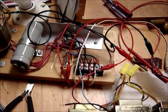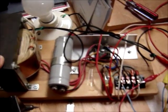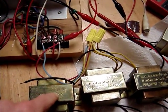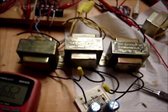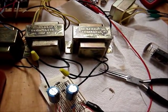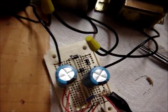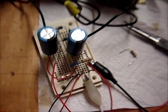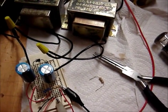I don't have a high voltage transformer and the amplifier is down for service. So what I did is took this large 12-volt supply here — it has an AC output — and ran it into the secondaries of these 12-volt transformers. The primary side, which is now the secondary side, gives 120 volts each in series, so that gives you a high voltage of 360 volts. After you rectify it with a full wave rectifier and filter it, with a little load I get around 450 to 460 volts.